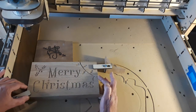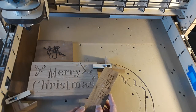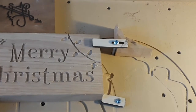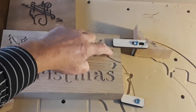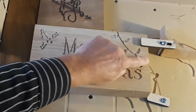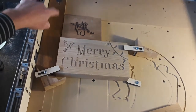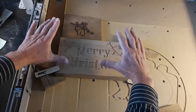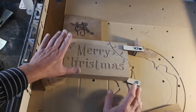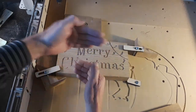I continue that path on, keeping in mind any obstacles like wires or fixtures that extend off the edge, drawing lines that account for every object the tool might pass over. So I end up with a kind of irregular shape — a path that comes over, up to an edge, up to the highest point, and then home. That entire pathway I like to keep free from any kind of clamps whatsoever. That way, no matter where the tool goes, it is not going to strike anything that's going to cause damage. That's the first thing: create that envelope in the Y and X axis.